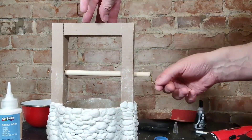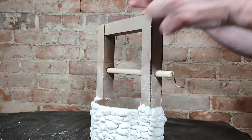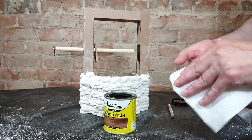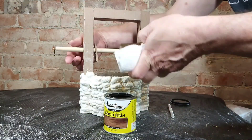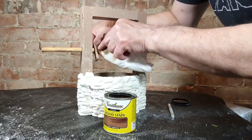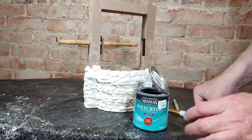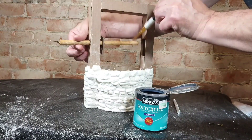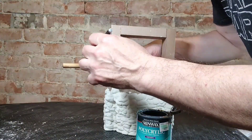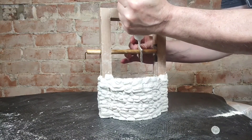After I did that, I realized that I did not finish the shaft — I didn't stain or finish it like I wanted to, which I should have done before I did all that other stuff. So I had to cut another panel and pull it out. I just wiped some stain on with a paper towel, and I'm sticking a paper towel down in there so I can paint it with some polyurethane — this is a water-based polycrylic, I believe it's called. And when that's all done and dry, I just glue that panel back in that I cut out.